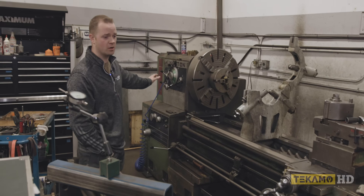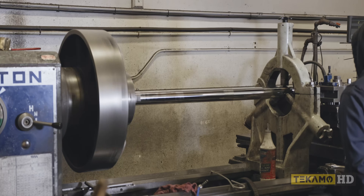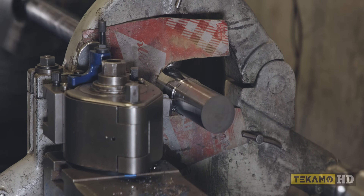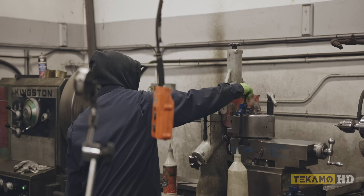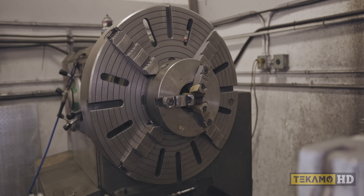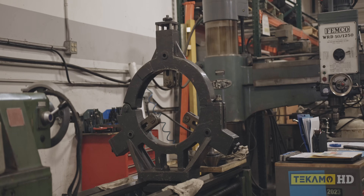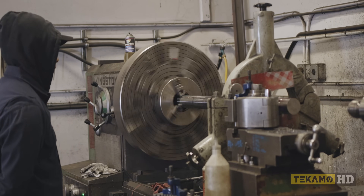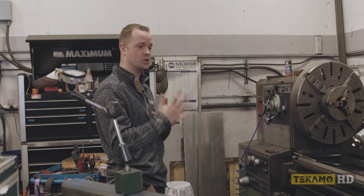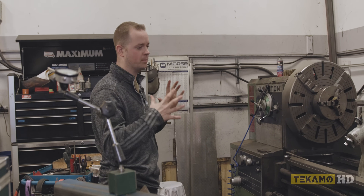This is a Kingston HR4000 — that's a four-meter lathe. This lathe dictates what we can produce and repair in this shop. When I get a big job that's within this, I can fix it no problem. If I've got issues with the thread, I can machine it, reweld it, remachine it, machine it smaller, drill and tap it, machine a slug to put inside to change the diameters. Largest diameter we can swing on our lathe and actually turn is going to be 34 inches. We're not really going to see a 34-inch cylinder — the largest we've ever manufactured is a 24-inch OD, and that's a big press cylinder.